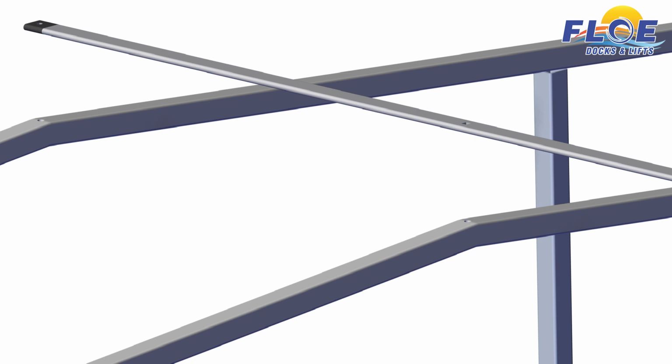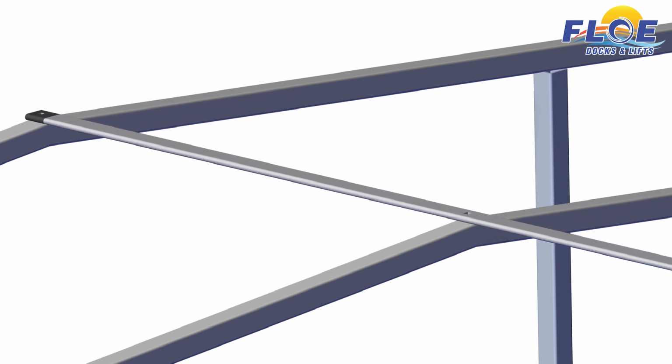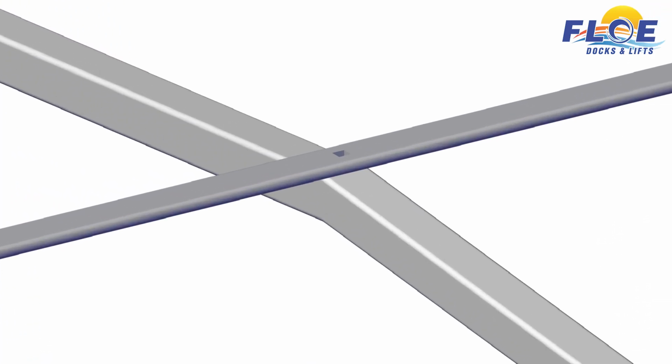When fastening the support rails to the hoops, start from the center and work your way out. This is done for 2 reasons. First, if you're fastening the rails by yourself, starting from the center and working out is much easier. This method will also prevent potential bowing in the rail or canting of bolts. Insert a 1.5-inch carriage bolt and a 1/4-inch nylock nut from step 6 of your canopy fastener card.